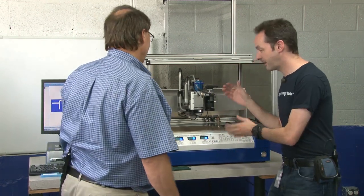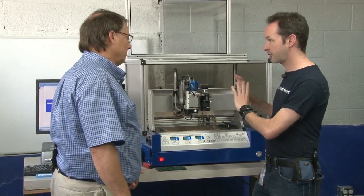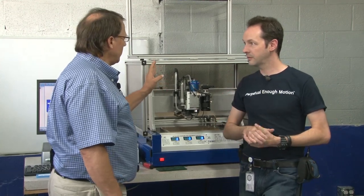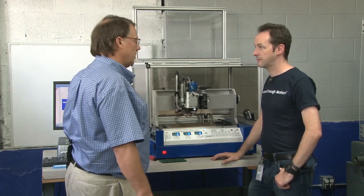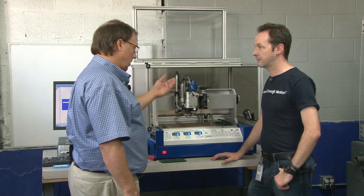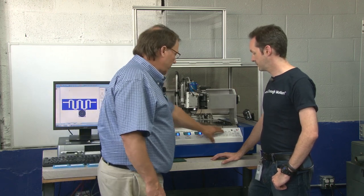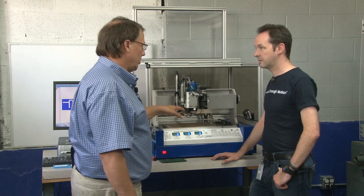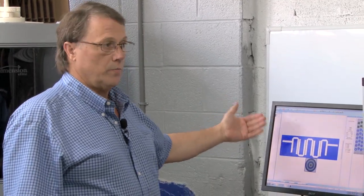But this is night and day. That's where you were 20 years ago, and this is where you are now — this is a totally different thing. This machine has a 60,000 RPM spindle. It has a camera alignment system. It has auto tool change for changing the tools. It runs unattended. You load your Gerber data, set up the file, let it run, and it changes the tools until your board is done. It has a front panel control system where you can manually operate the machine, as well as everything is duplicated to allow you to run the machine from the computer.